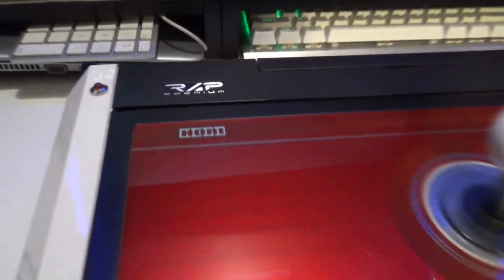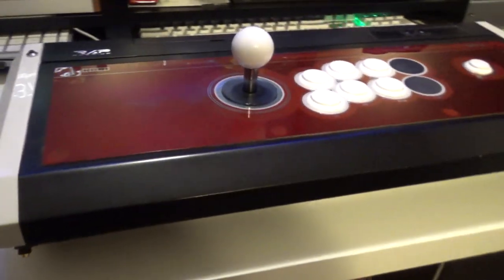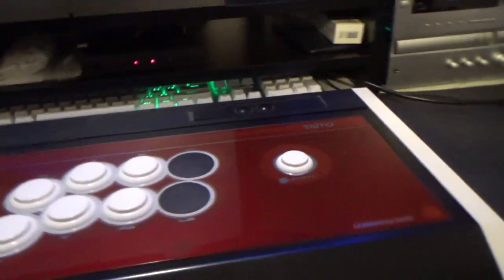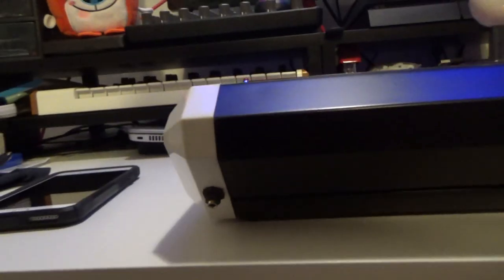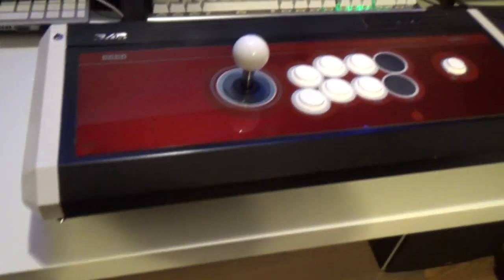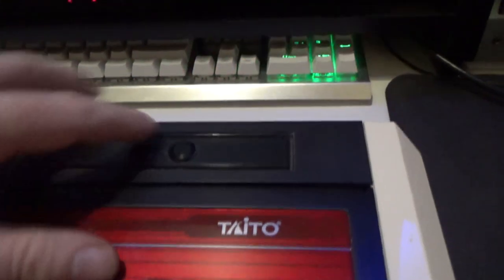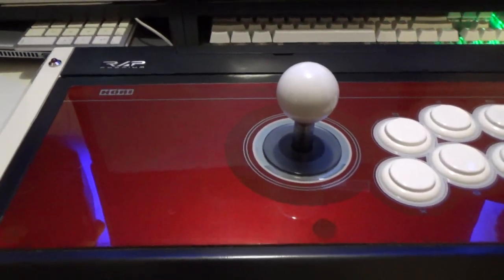So as I'm sure some of you already know what this is — this is a Hori RAP Premium VLX, modeled after the Vewlix arcade cabinet. Basically this is modeled after the Street Fighter IV era Vewlix. Eight buttons originally, but again I've got to play with six. I can't have that — it just messes with me. We have our start button over there. Now this stick I actually did rescue — it was modified and cut and all kinds of crazy stuff. You can see here it's got a little LED light plugged into it, and over here it's got like a headphone jack. I did not do any of those mods — this was how I got the stick. When I got it, it didn't have any PCB in it; it was missing a bunch of stuff. I actually 3D printed a panel here, so this has two kind of recessed buttons. This is start, this is select and home. And on the back here we have our other two buttons that originally were L1 and L2. But this currently just has an MC Cthulhu in it, so it's PS3, PC, that kind of thing. But we're going to be putting the Brook into it.